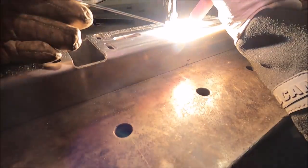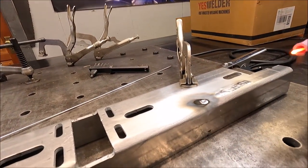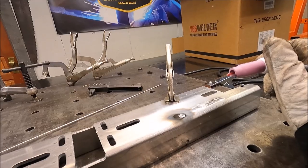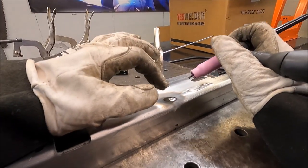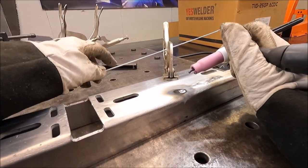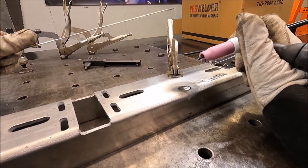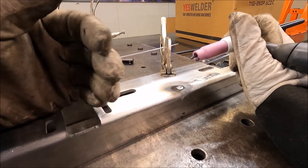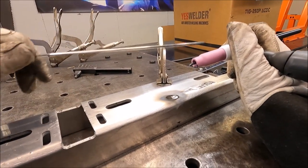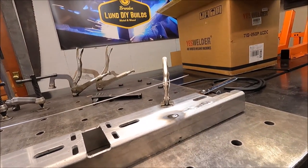The key is to not add your filler metal until you're actually ready to start welding. You want to make sure you've melted the base metal and a puddle starts forming before you introduce filler. Because if you introduce it too soon, it's kind of like soldering a pipe — if you just hold solder in front of the pipe and melt it, it just starts dripping all over. That's what it'll do here as well. I dipped the tungsten and it made a hell of a mess, so I'll wire brush this down and resharpen it.